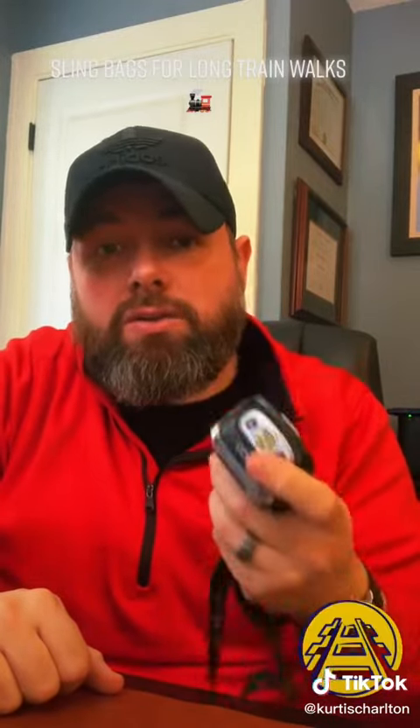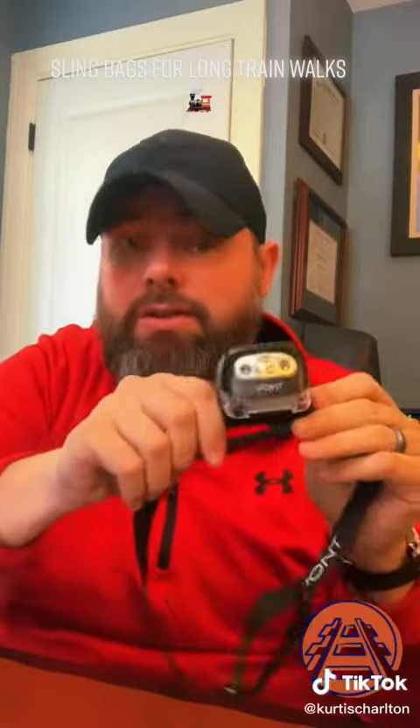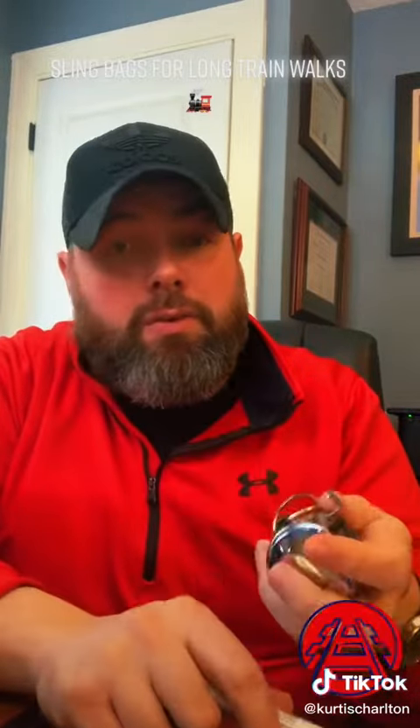If you have small bungee cords too, you can toss those in that bag. Another thing: headlamps. Even though you can't use this for hand signals, you want to make sure that you have one of these on you when you take that walk, especially at night. While you're working on whatever that happens to be, this frees up your hands. In addition to that, a car counter — if you were given any information on how far back it may have been, maybe a separation was seen by a passing train and they say it's separated 20 cars from the end, the car counter tells you where you're going. Temp stick — if you need to check the heat of the wheel to see if it's something you can continue on with, take that with you.